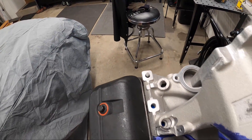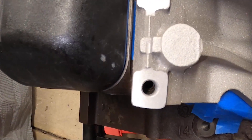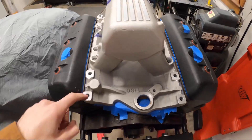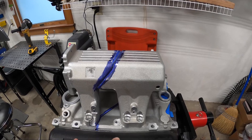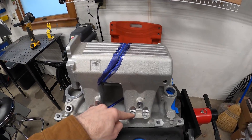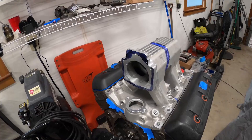I have some alignment bolts in the front. I have no idea if you can see that, but it's pretty close. I'm not using those to do the alignment though — I'm actually using the injector ports, because this is set to the bore spacing of the engine. So this is 4.4 inches center line to center line. I'm just using calipers to measure that on both sides. So that's a trick for anyone that's crazy enough to try this other than me — it's coming together pretty good.